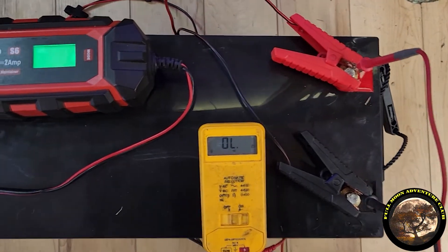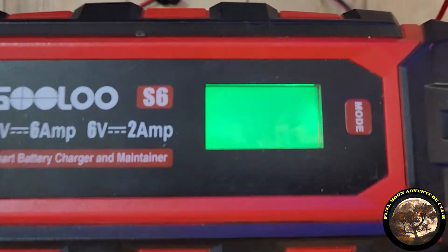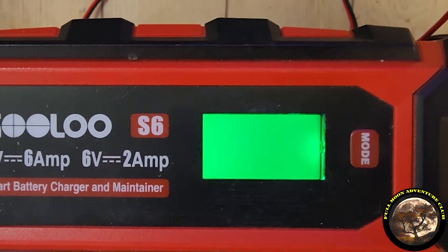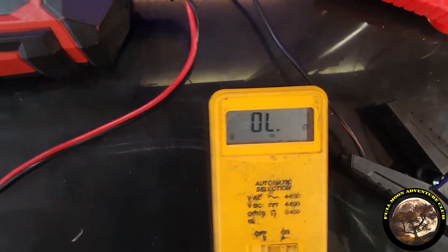What you have to do — that battery is going to have zero voltage whenever you check it with a multimeter from there on out until it wakes back up. So if you're getting zero volts on your battery and you can't charge it because your charger is not reading that it's connected to a battery — it doesn't say low voltage, it's not getting 10 volts or anything else, it's getting zero — so it thinks it's not even connected, and your charger can't charge the battery on its own, unless it has a wake-up function built into the charger, which a lot don't.